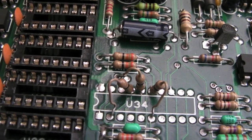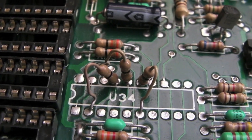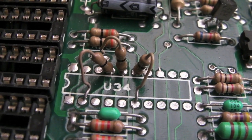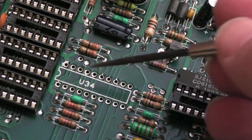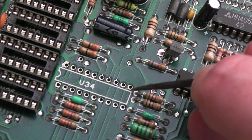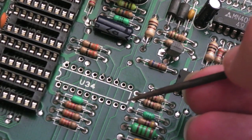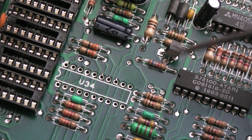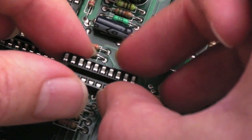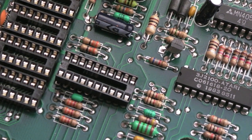Rather than take a picture, I thought I'd just film up close — just so I can see where those components are. The little resistors are probably zero-ohm or very low resistance. I'm going to remove those and get a socket on there, get that new chip in. You could put a 14-pin socket on there left-aligned to pin one, but there are two connections on the top side that are used on those six pins — I think Atari did that to support maybe another future model, maybe up to 256K. In any case, I'll fit the full-size socket so that if I decide to swap the chip for a GAL or PAL in future, I've got the right size socket and don't have to remove and replace it.